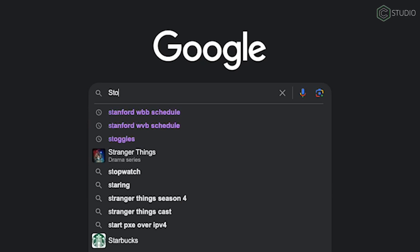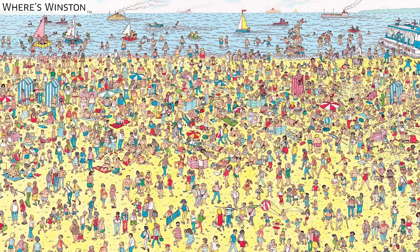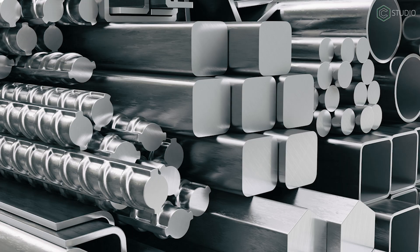You'll read about all of these things on the internet — don't let them stop you. Let's bring in some engineering expertise. Winston Moy, when you're starting with metal, what should you start with — aluminum, brass, copper? In general, aluminum is the easiest. All metals have a range of different alloys, and some are better than others. Aluminum is softer and easier to cut than copper or brass, so that's the best starting point if you're not sure what you can cut safely.